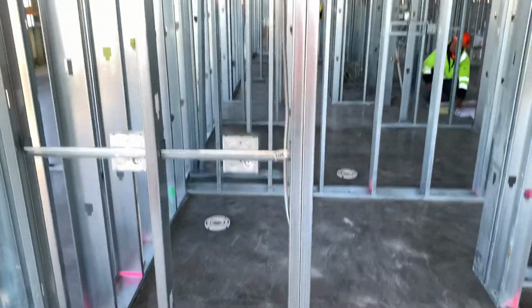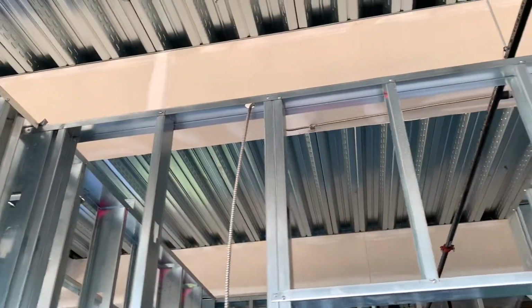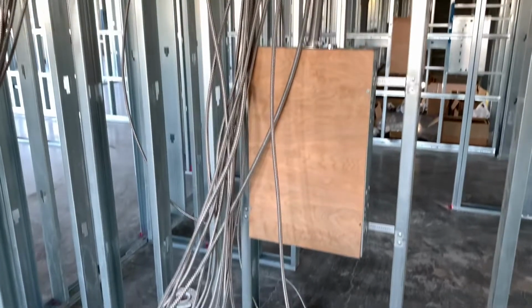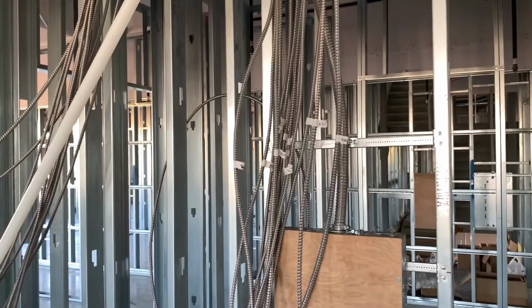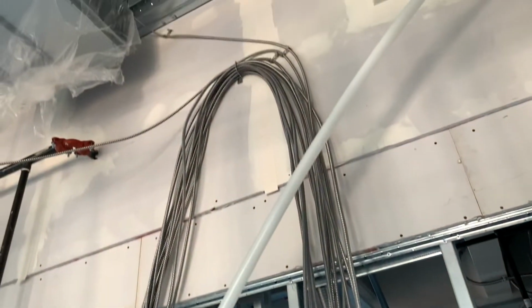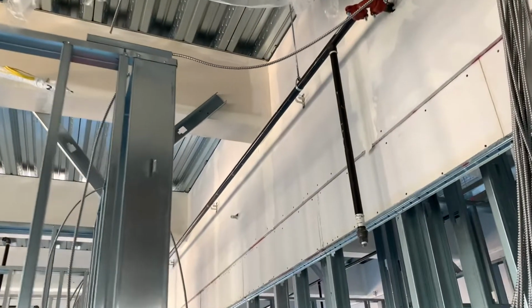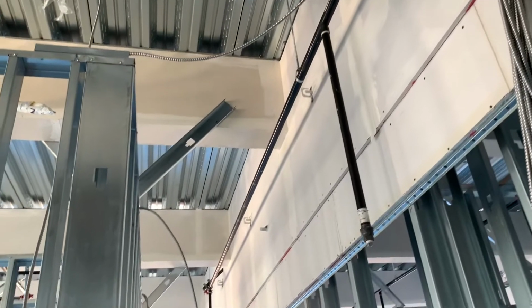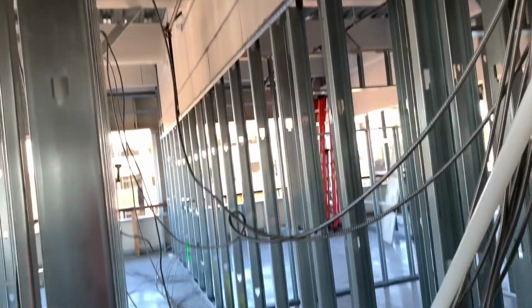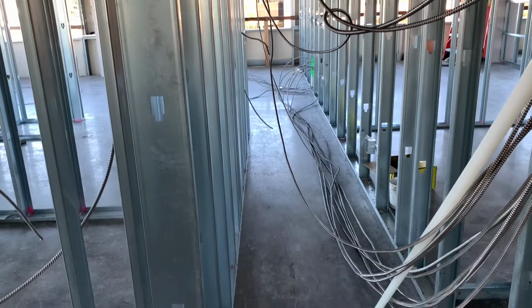And then worked on punching the holes for the wire down the metal. And in this one that we didn't get quite finished yet, got everything labeled at the panel for all the circuits. There's about 14 circuits per unit so far. There might be more in double units or double bedroom units. But as you can see, you got one up there for the fan coil unit, which should probably be in every unit. And then other circuits include 2 kitchen circuits, microwave, dishwasher, disposal, stove, 2 bedrooms, bathroom, water heater. What else is there? Washer, dryer.